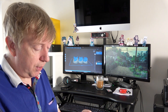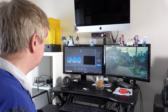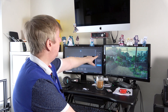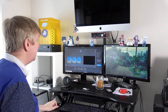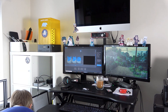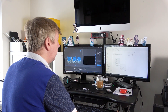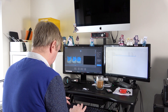While that's slicing I'll show you the way I transfer this program to the printers. I simply use one of these little memory sticks — I've actually got two of them, one for the Saturn and one for the Mars, and they've even got S and M written on them. So this is going to be printed on the Saturn. It's now sliced and it's telling me it's going to use a volume of 79 millilitres, the finished weight of the whole project will be 87 grams, it's going to cost me about two dollars and 39 cents in resin, and it's going to take just under three hours.